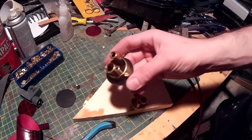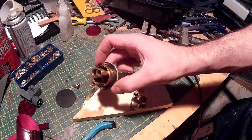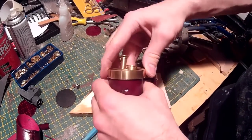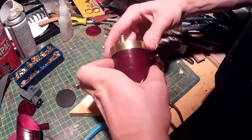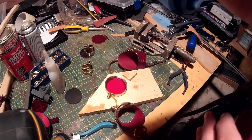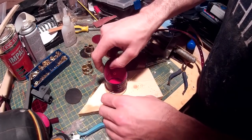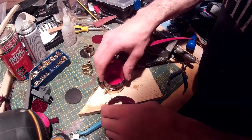I've mounted my lens assembly onto a piece of wood which also has a piece of plastic on the front to create a nice smooth finish — as you can see that just fits in there. It's worth taking care to make sure the lens is exactly straight, so I've spent quite a lot of time looking at it from a variety of different angles to make sure everything lined up and didn't look skewed. The leather itself is held to the brass bush simply with some super glue — I'm just putting glue around the edges and carefully putting it in place. Be careful not to get glue on the lens itself as that will show up, so move slowly and don't put too much glue on.